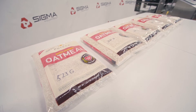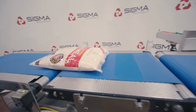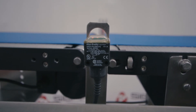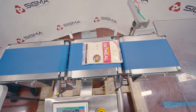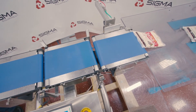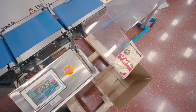This specific machine is set to a target weight of 518 grams. The operator sets the target weight followed by the upper allowable weight and the lower allowable weight. The first product is placed on the infeed conveyor and moves over the load cell where it is weighed. When the product passes through the beam from the photo eye, the unit knows when to start looking for the weight to cross the load cell. Package length and conveyor speed are part of the load cell calculations. If the weight meets requirements, the product moves on; if not, a pneumatic arm pushes the product into a reject container.